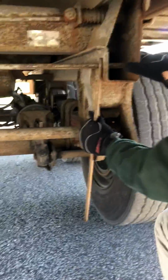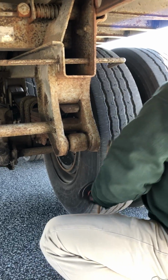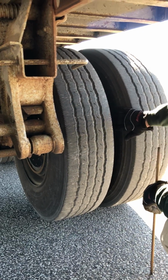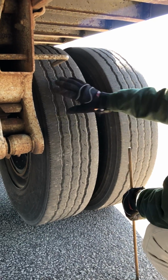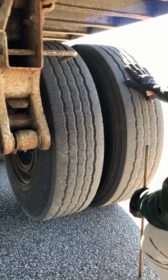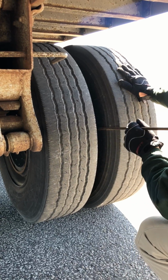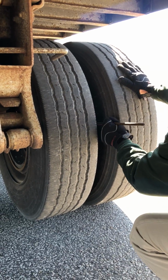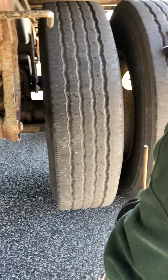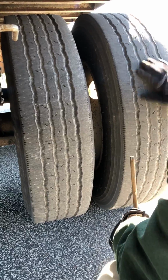Now I'm going to talk about the sidewalls on both my tires. They're both properly mounted, secured, not cracked, damaged, loose. They're not leaking. There are no abrasions, bumps, or cuts. Tops of my tires are wearing evenly. Must have a minimum of 2/32 tread depth on these, and I would check that with a tread depth gauge. My spacing and my rims are properly mounted, secured, not cracked, damaged, or loose. There's no debris, and the tires are not rubbing together, which could cause a fire.